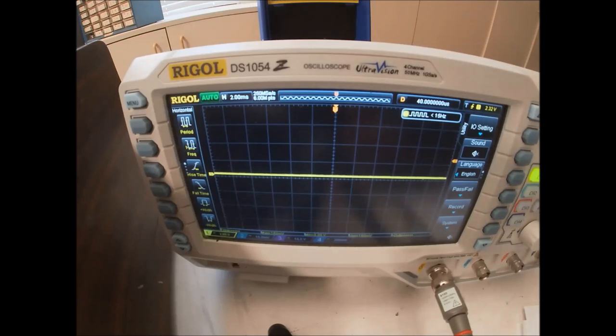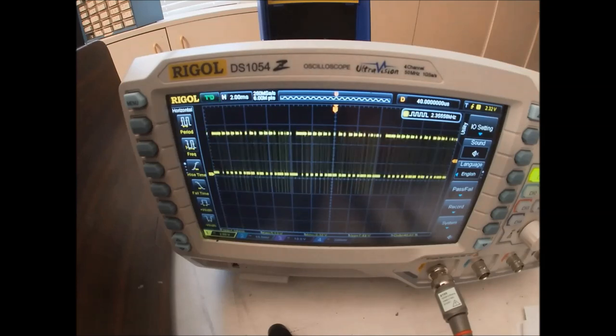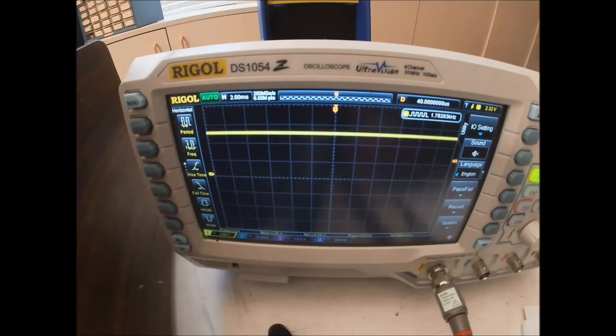First, let's go back to IC9 and see what the inputs look like on a working one. So we'll go back to that bit 6. The inputs are on pin 13 and pin 12, and that's the output. So this is just configured as an inverter. So let's take a look at the inputs on one of the gates on IC10. So we'll go to pin 1.